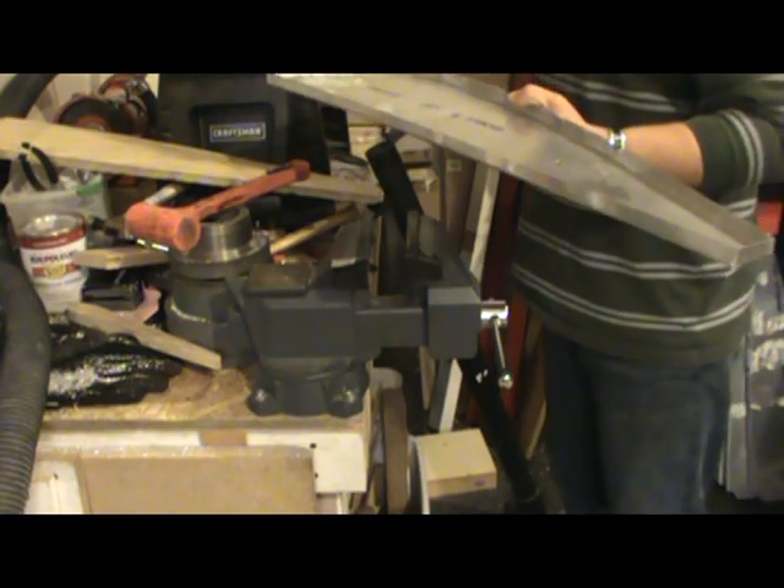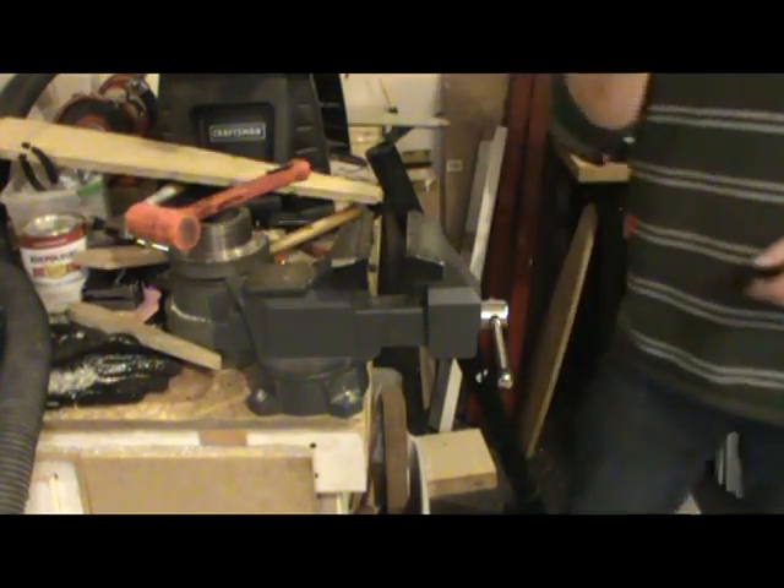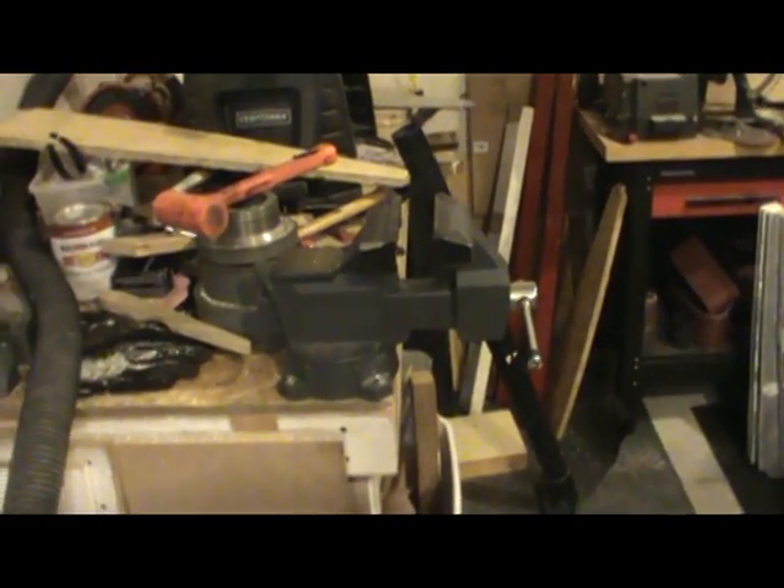Popping that apart, you've got your nicely formed wing rib — in this case it's the rear rib. Factory formed parts always turn out a little better than this; there's not much you can do about that unless you have access to professional grade equipment like bending brakes. So you'll notice sitting on my router table there's quite a bow to it — it's fairly banana-shaped. The way you adjust that is again with your fluting pliers: you go into those crimping locations and put a slightly deeper crimp in, gently going down along the line, and it takes that banana shape right out of your wing rib.